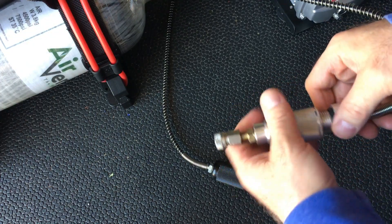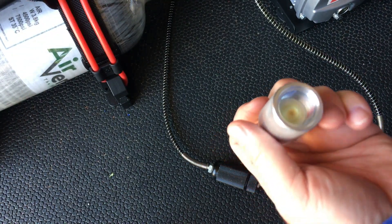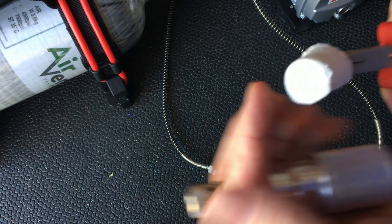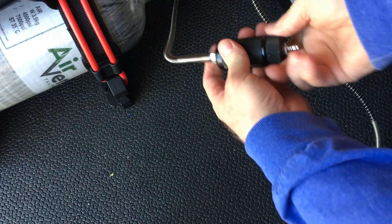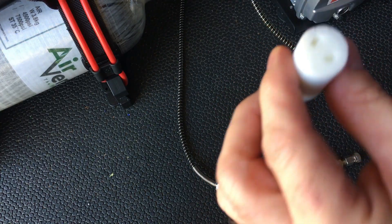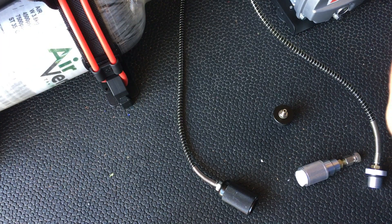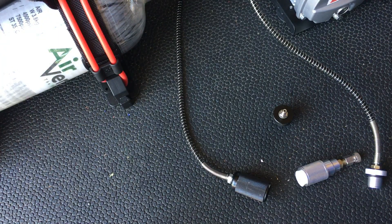At 1000 PSI: this is the second filter on stage one. The other end looks not bad - you can still see there's a little moisture and oil there. Stage two looks pretty good. The other side of it - no moisture. You can smell oil but no moisture. I would call that a success on those two.